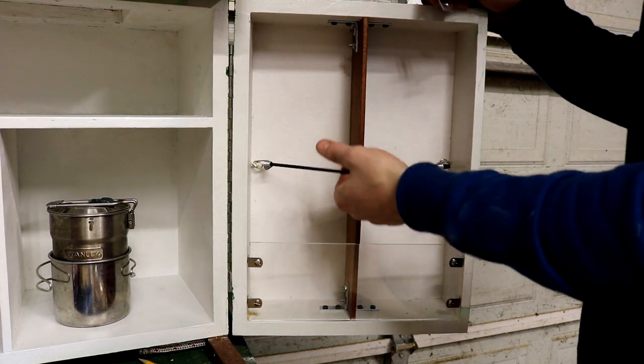And of course this little bungee cord is only attached using these little eyelets. Here's the completed box. Painting was really the hardest part of this project - it took forever, hours of painting. I probably could have done it easily in one weekend if I just sprayed some clear coat on it like I usually do. It took forever to dry, especially in cold weather, so bring it inside where it's warm - above 50 degrees is usually good. The problem with overspray is that even if you're not pointing the can at the piece, little paint particles float in the air and settle on stuff you'd never expect.